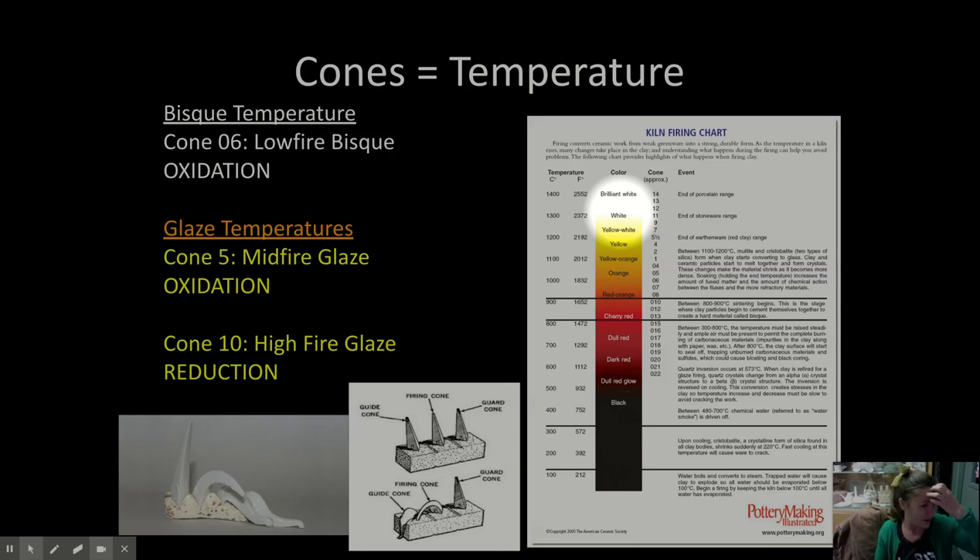One time at my old job, there was a little kiln disaster where something fell over and the kiln just took off and got way hotter than it was supposed to overnight. When I came in the next morning and peeked in the peephole, it was past white-hot — it was up in brilliant white. It was the brightest light I've ever seen in my whole life in a kiln, and I was scared to death. When you fire a kiln way past cone 10, it will literally melt the clay back down into magma again — like the pots themselves become liquid again. If you fire pots up to almost 3,000 degrees, they become molten.